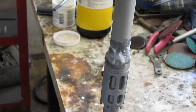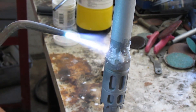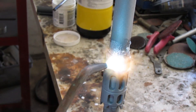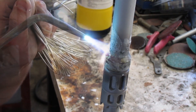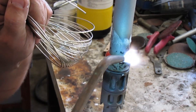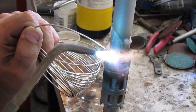Now we're going to liberally flux all the parts and put them together on a stainless steel heat sink to ensure even heating and that we won't warp the barrel or cause any kind of damage. Apply the heat mainly to the mounting collar on the KA-1212 or KA-1212BR and heat it up until it is a low orange color, then start feeding silver solder into the joint.